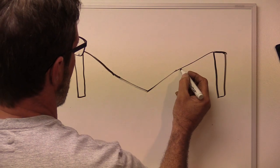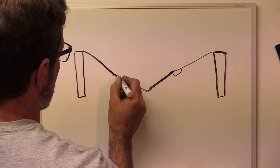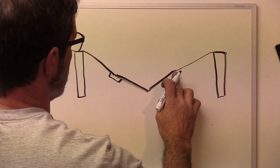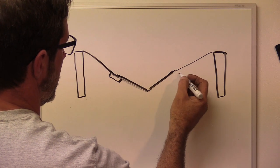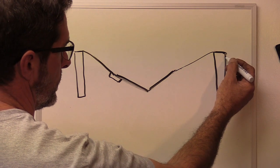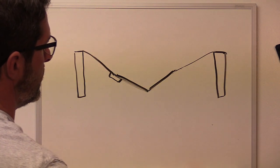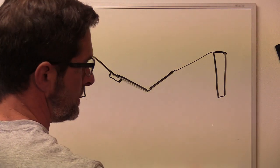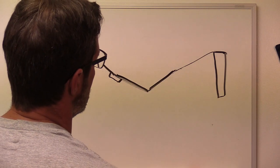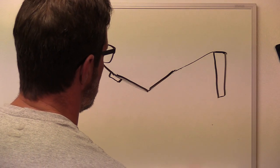And then I'm going to have to pull off that flat bar that connects the keel with the outer hull sections. I'm going to have to remove those. And regardless of this keel angle, I'm going to have to set the outer edge of the boat even and level on both sides. So I have to break all these tacks, which means taking the boat down to stage 1. I can leave the transom on. There's no reason for it to come off. It's square back there, it's level.